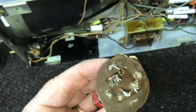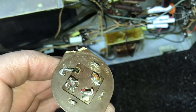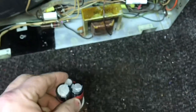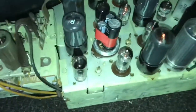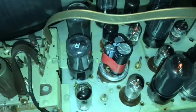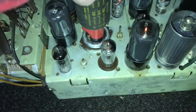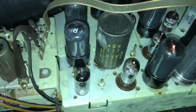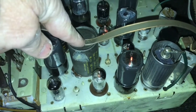All right, have all three caps mounted. I use just one ground wire coming to a lug on the outside. And all three are attached together internally there. Put a little tape around them just to hold them in position. Well, got the cap mounted back in. Got the new caps put in and everything hooked up. And this is a cover that goes on and it just slides on like that. May put a dab of silicone just to hold the cover tight. And there was a piece of tape went across the top to hold the antenna wire.